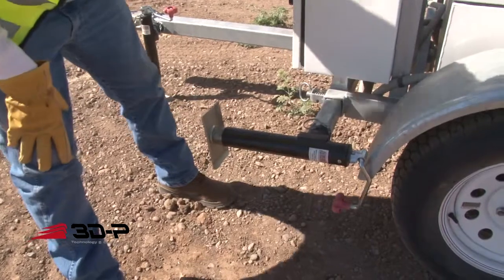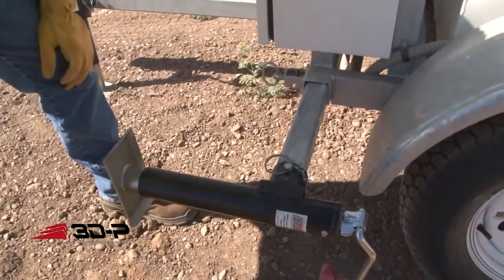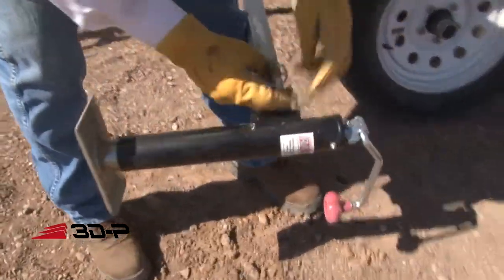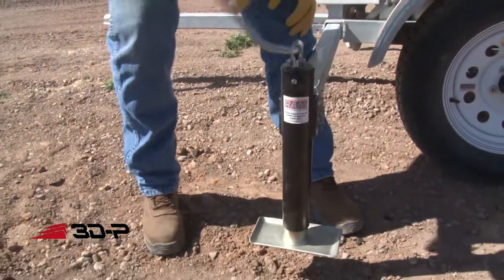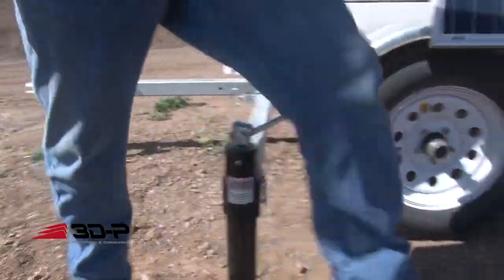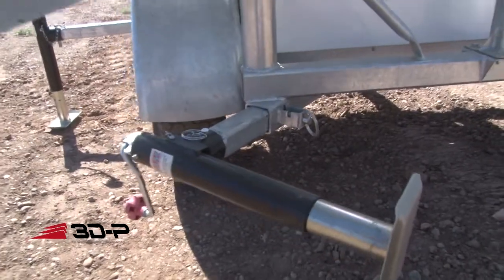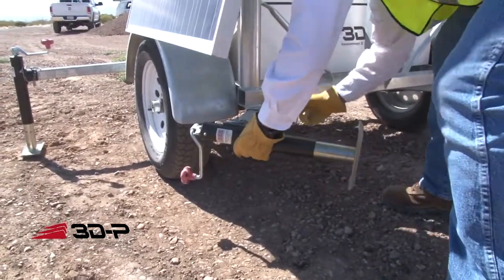Let me show you how these outriggers work. You pull the pin and then start to pull out your outrigger, keep pulling it out until it hits the next detent — that's locked in place. Then you pull the pin on the jack, rotate it around, replace the pin, and raise the jack. Back at the rear, these outriggers are similar. On this particular small trailer, we brought the outriggers out at a 45-degree angle to give us a bigger footprint. On some of the larger trailers that's not necessary, but this very lightweight small trailer needed a little larger footprint — same kind of operation.